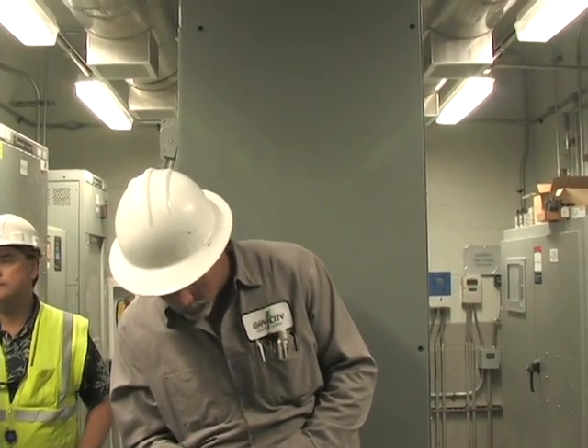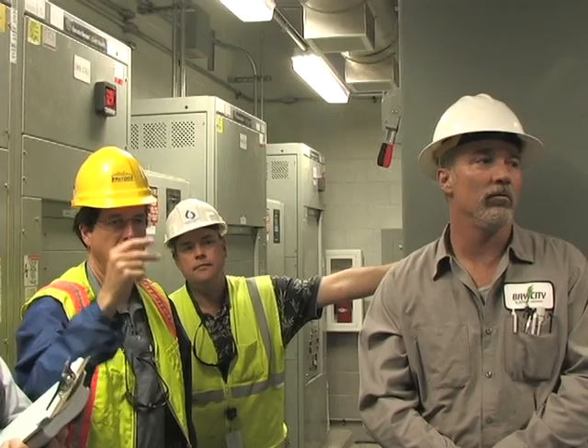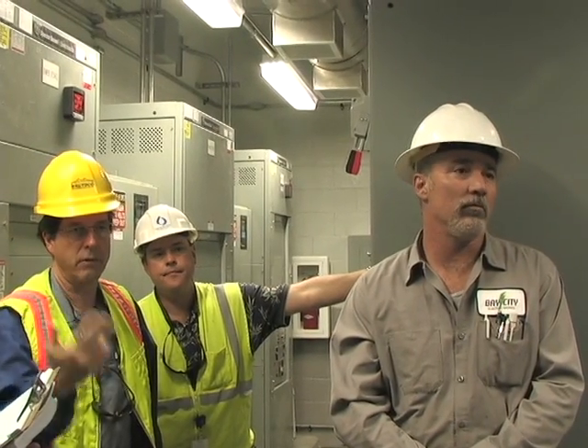The same applies with elevator switches and air conditioning. What we ran across here was two two-pole breakers on a three-phase panel, side by side. So this ATS was seeing a phase difference — even though you're using only single phase, it says it's not going to switch to an offsetting or out-of-phase load, so it holds and doesn't transfer. We actually ran the UPS battery down on the standby because it wouldn't transfer over to generator power. That was a good test — I've already alerted folks. It's just a matter of switching that breaker down one set so it's both on A, B, or whatever.